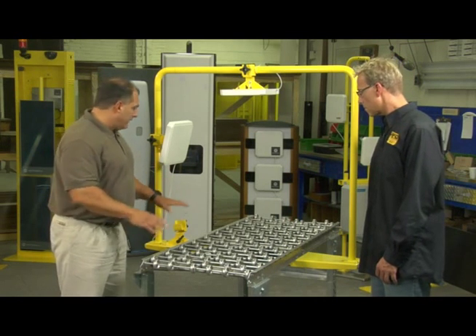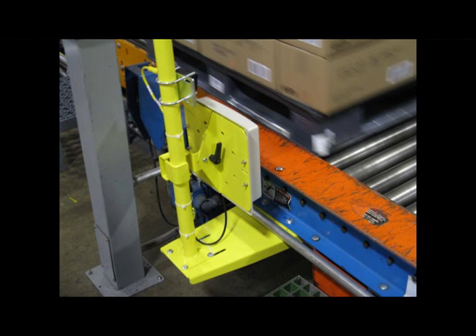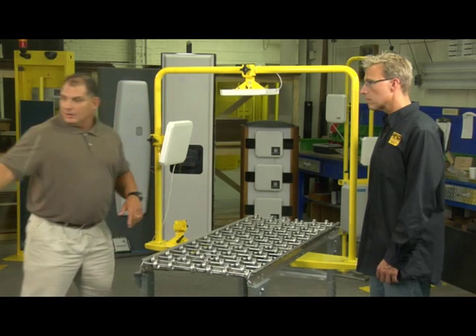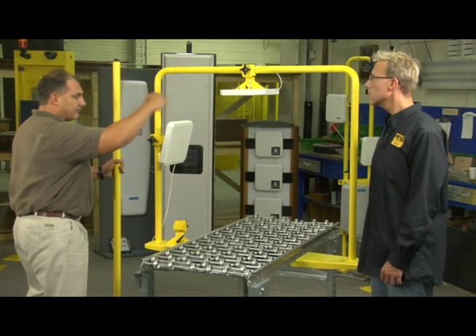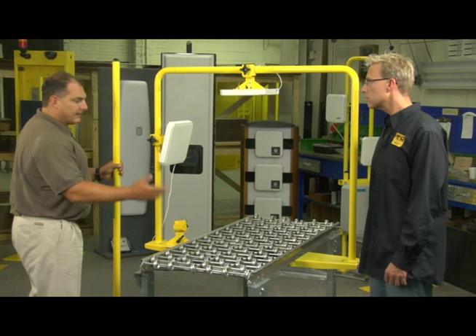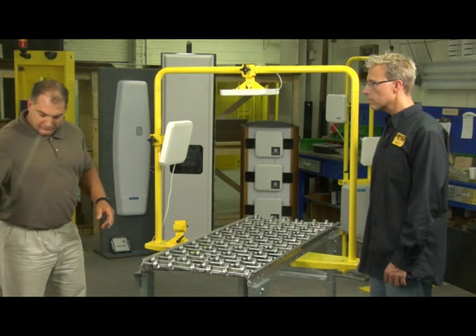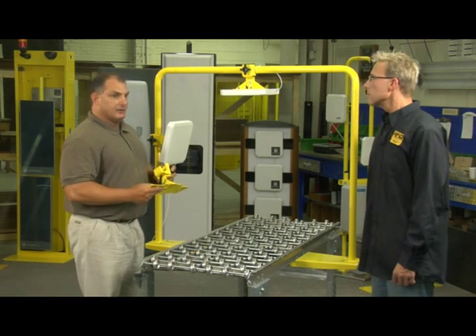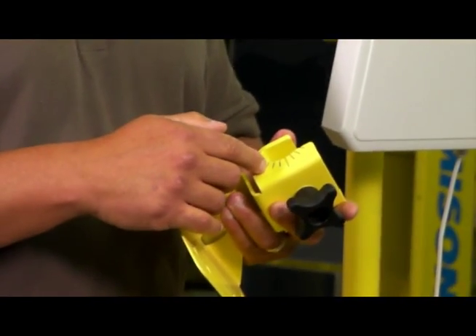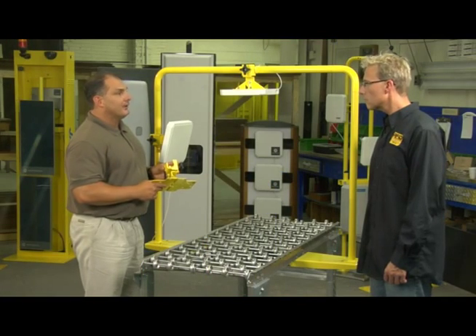What we have here is a good solid metal conveyor system. This very industrial setup allows us to mount directly to the conveyor. We have to understand how the RF field is going to be impacted by the rollers and the roller rods. If we were going to go to a freestanding type of installation, we've got some great adapter rods here that allow us to mount freestanding right around the conveyor without actually touching or impacting the conveyor. When we look at adjusting antennas, they've got a great bracket here which allows not only quick mounting with tool-less adjustments, but they've actually got laser-etched 15-degree hash marks that, when aligned properly, give us both azimuth and elevation measurement marks and allow us to easily adjust and tune our antennas. So they've even got some good measuring tools built right into the brackets.